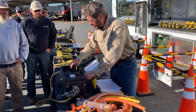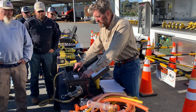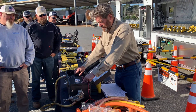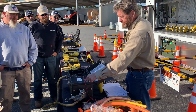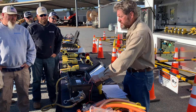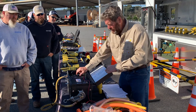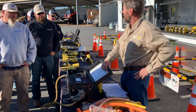So we're going to do that. We're going to dial up the Variac and go up to 300 amps. We've got about 300 amps, and we've got a 0.20 voltage drop. This actually passes. If you've got a 0.24 voltage drop or less, it passes.